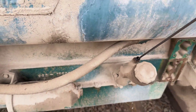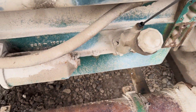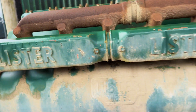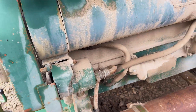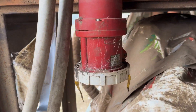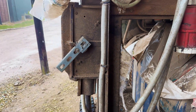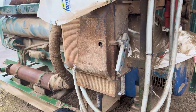We just had to replace the tyre on here because that had finally given up after many years of being very perished from the fire. There's a huge amount of oil in this thing — it's still clean because it does very, very little. I last did this on the 4th of October 2011 where I changed the oil in the engine and put new belts on. I think it's a 100 kVA generator. We've got a 125 three-phase plug on here that we can power either the farm shop or a new setup we're going to install for the farm.